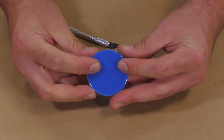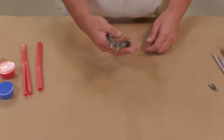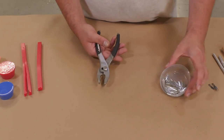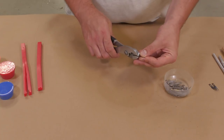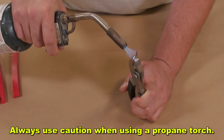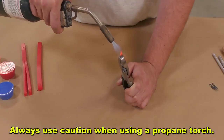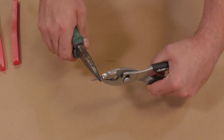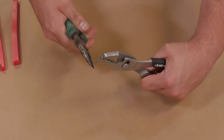I'm going to show you how to make your very own blades very inexpensively. Simply grab a pair of pliers and some razor blades that you use on your knives in the mold making process. What I'm going to do is simply heat up the blade until it's nice and orange. The metal will soften and we're going to be able to bend it easily with a second pair of pliers. These are needle nose pliers and I'm simply going to bend the blade in three spots, creating a U-shape or V-shape blade.